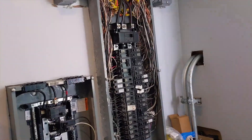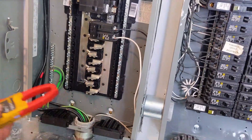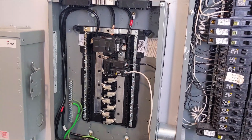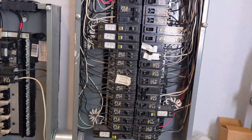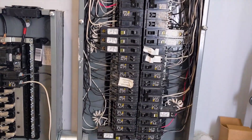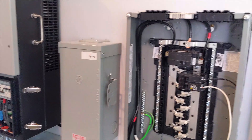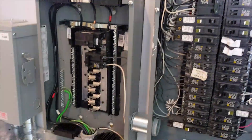Monday we'll be moving circuits into the critical loads panel. That makes me think — we're probably not going to be doing critical loads panels much longer. There are smart load panels coming: a module that sits with relays tied to your main panel, giving you more capability to run, manage, and load-shave these loads. Next year we'll be putting smart modules in instead of critical loads panels on both the 12K and the 15K. Hint hint, SolarArc — hope to be a beta tester.